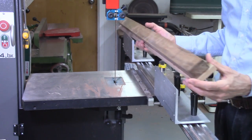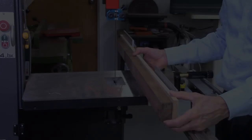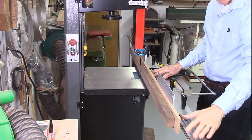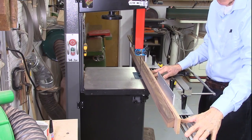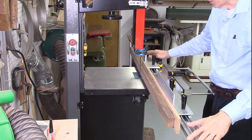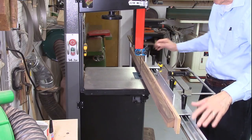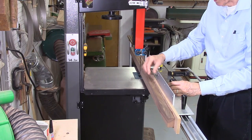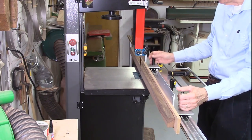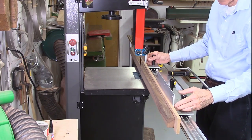And then in this case, because the board is so long, it doesn't fit on one carriage, I actually need to use 2 carriages. I just installed my 8-foot rail on the Accu-Slice system, and I support the rail on 2 ends with 2 supports to reduce vibration of this long rail, since it hangs over the table by quite a bit. And then I've mounted my board, which is glued to a piece of MDF, to 2 12-inch carriages. And it's just screwed in 4 different places.